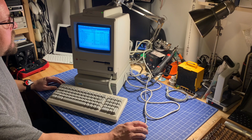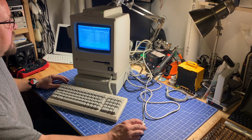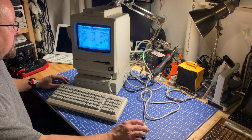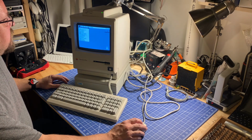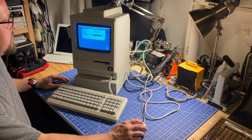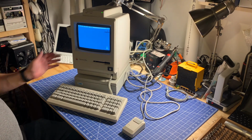Alright, so on Home Computer, we've got what appears to be a 30 meg hard drive. We've got 18.2 megs used, 11.9 free. Some random stuff on here: Adobe Illustrator 3.2, Quicken 5, Super Paint 3.0, Word 4.0. Looks like maybe a game, Golf, and just some random other personal files that we'll clean up later. So checking About This Macintosh, it's showing as a Macintosh Plus running System Software 7.0. It does have the 4 megs as I speculated. And I presume that if we did a speed check, we could see if it's actually running at 16 megahertz.